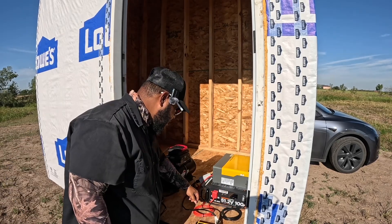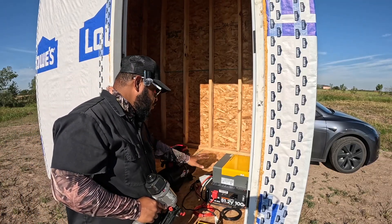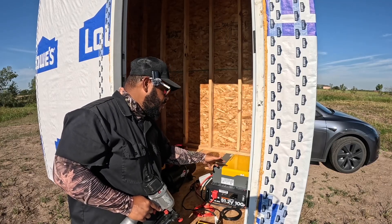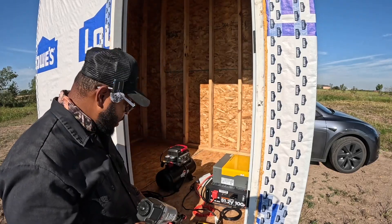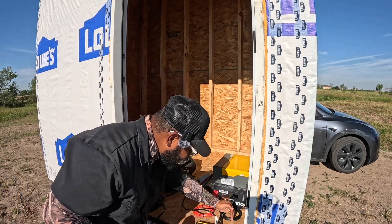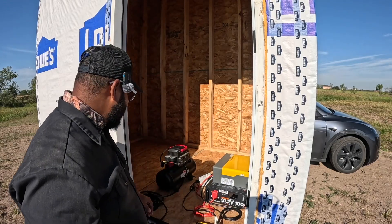Let's fire this thing up. We'll hear that beep in a minute — yep, that's right on. The inverter turned on, which means the battery is definitely connected. I'm waiting for the screen — 53 volts, okay, it's getting the voltage from it. I'm gonna turn the surge protector on — it's hard to see out here in the sun but the protected light is lit up.